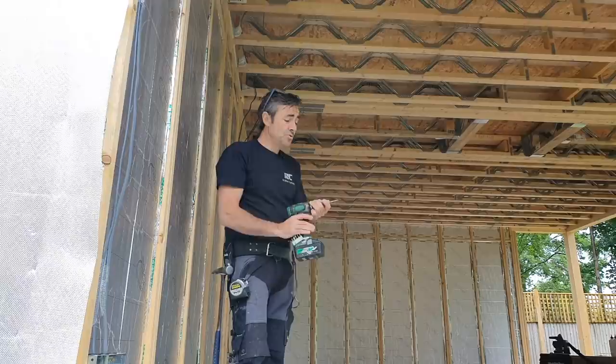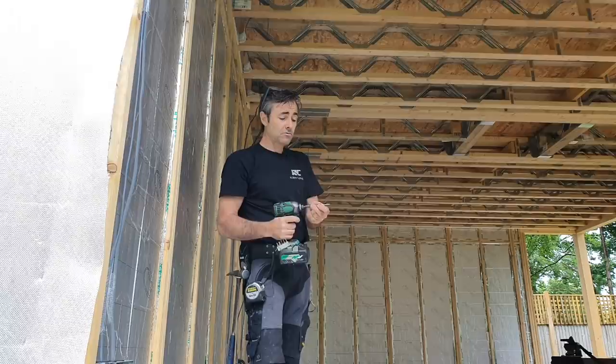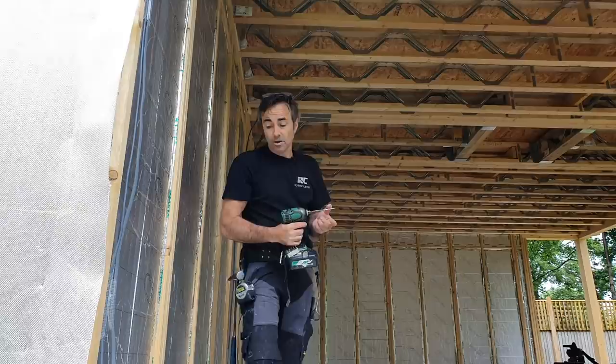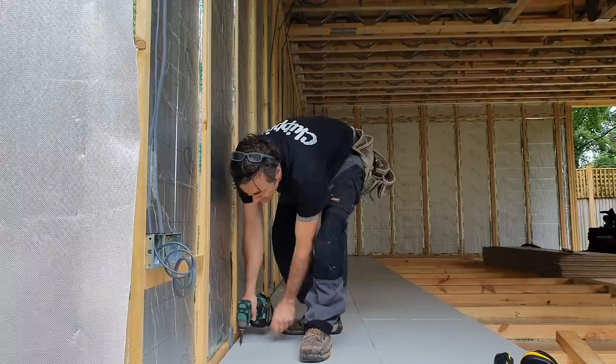The technology in a screw now, this is a flooring screw, a particular flooring screw, and it's got a smooth shank in the middle, if you like. So when you're biting through, it allows the board to be pulled down tight if you're going to be doing that. So that's it now. I'm going to go through and get all of mine fixed on the joist everywhere, all the way through.